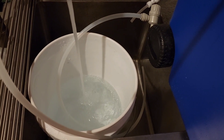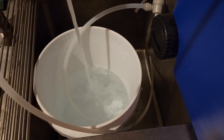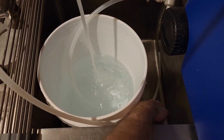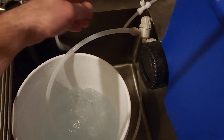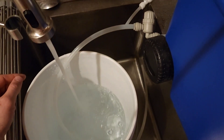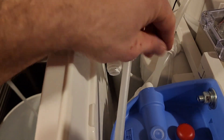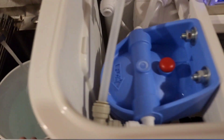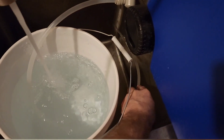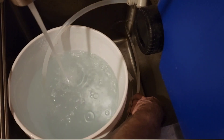We're filling up a five gallon bucket here with tap water. We're going to use this to run through to flush our carbon block filter before we actually start flushing the RO membranes. We've got the output coming out down here and we'll get a glass of that water to do a chemical test to see if our chlorine parts per million are lower. We'll probably run about 10 to 15 minutes — it may be more than five gallons — and then we'll switch the plumbing back over and actually start the flush.